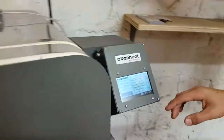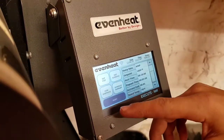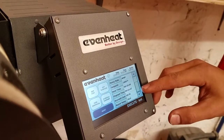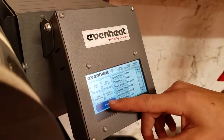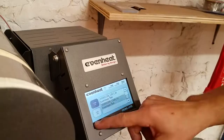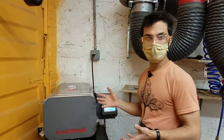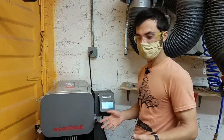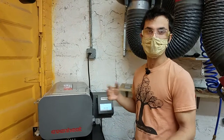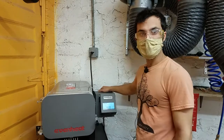We'll come look at a few other features and then we'll be wrapped up. You can skip a step if you want, you can view the graphical display of the temperatures increasing, and you can see the schedule summary which we've already looked at. We've accrued one cent of cost thus far. I'm going to abort it now — yes, I'm sure. It's already up to 277 degrees, which is pretty toasty. I'm just going to turn the switch off in the back. If there is a mess in there from whatever happened, once it's cool please do clean it up. If you think there's a risk of something spilling, we have extra fire bricks you can put down to protect the bottom. We don't want to hurt the inside because you can't really replace the bricks very easily, so just be mindful of not spilling metal or other things in there. Thanks for watching.